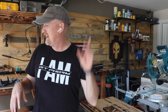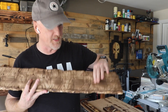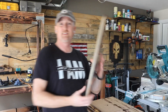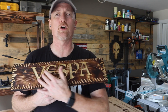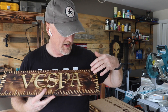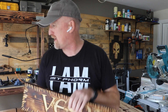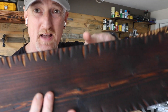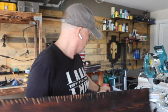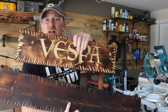I'm on my third draft of this now. Let me take you through how this went down. I originally had carved this for the coat hooks, carved it, burnt it, and then brushed it. I was okay with that — until I made this sign. I was originally going to carve my last name in here, fill it with epoxy, sand it down, and just burn around the edges. But I liked the way the carve looked so well that I just went ahead and burnt the face of it and sanded it back out. The problem was it doesn't look anything like the coat rack board. My second draft had the same edge profile as the sign so they'd match. But I burnt it deep and brushed it, giving it a darker tone — so again it didn't match the sign. So I scrapped that one too.